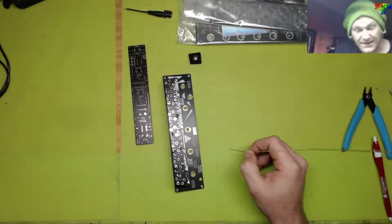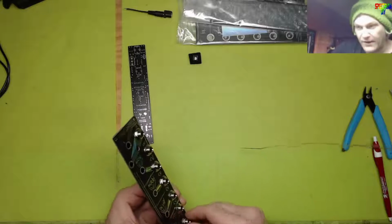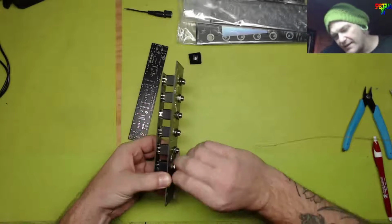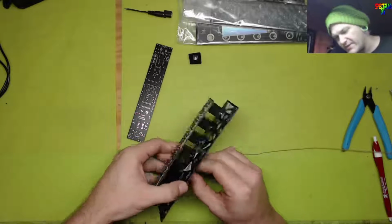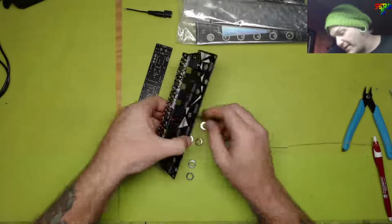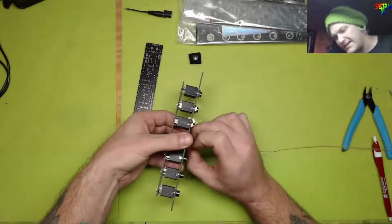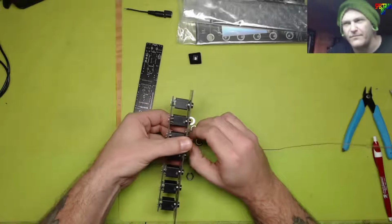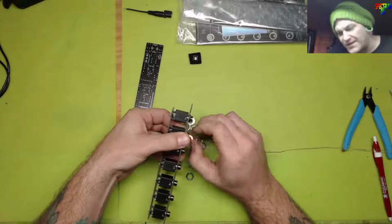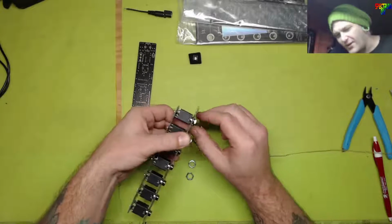I mean, it's very useful, because you're setting tuning based off of the main tuning, and you're taking the output of each oscillator and corresponding it to the tuner portion of the circuit. So like you would actually need to add a switch unless you got rid of 4 knobs. You would either have 1 knob and that's it, or you would have switches to disengage the tuners. To transition from tuning, you would need an on-off-on. So transition from the tuner to the knob that just freehand tunes, if that makes sense. Like, I guess you would label it slave or solo.